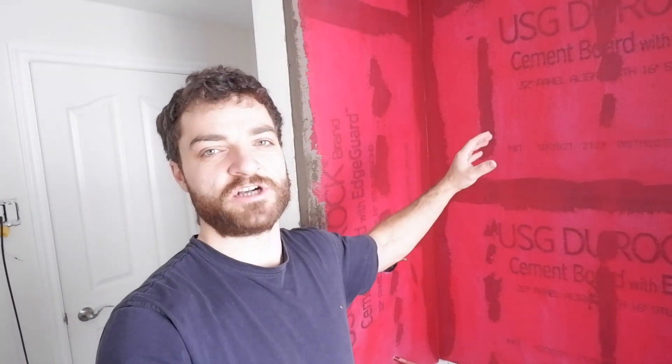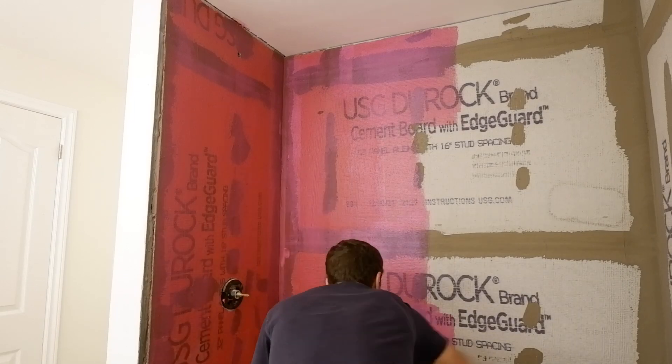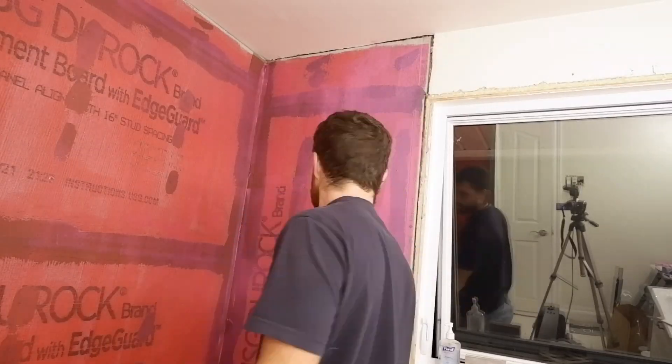Good morning — it is the next day. Last night I applied a coat of RedGuard after our mortar on the seams dried. It's a pretty easy application — it's just a matter of rolling it on and making sure you get even coverage. And then this morning I did a second coat, which is already dry. It doesn't take too long — about an hour to two hours depending on a few things. We are pretty much ready to go to begin tiling. That will do it for this episode. In the next episode I'll begin the tiling. Thanks for watching and I'll see you in that one.